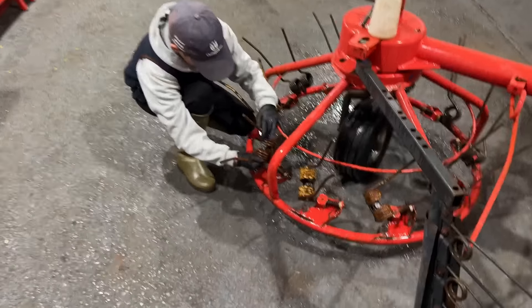I've managed to get this pin out on both sides. Now we need to block up the bobbins on the bottom to be able to bang them down - the hard bit will be banging them back up again because you've got the wheel in the way. I paid just over £500 for this Hay Bob, which is a pretty good buy. But if those shafts were free and easily working, I'd easily put an extra £300 on this Hay Bob - because that's the biggest thing that fails on these. If you're looking to buy one, make sure you check those shafts aren't seized.